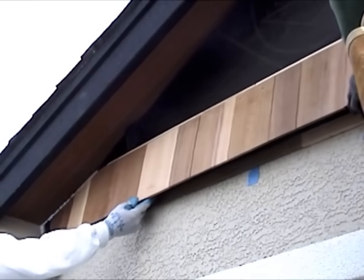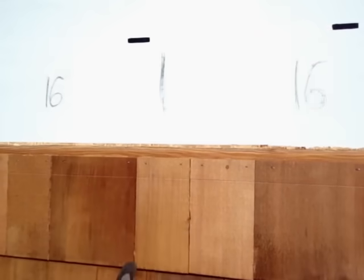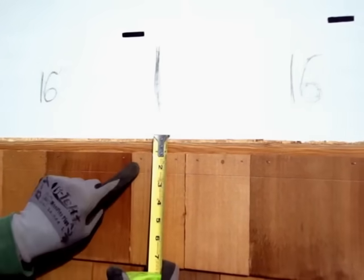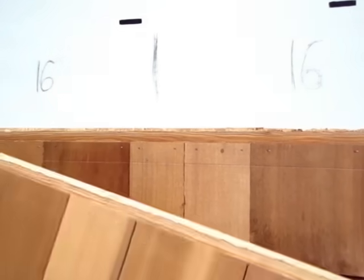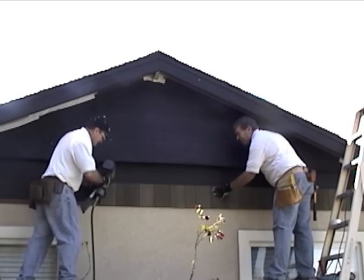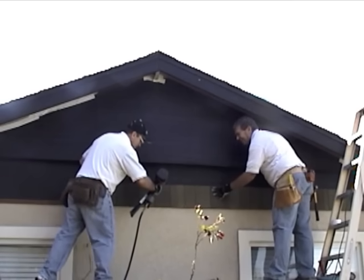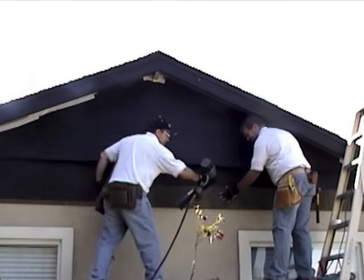Set the panel in place tightly against the caulk trim piece and nail properly. Note, we are blind nailing the shingle panels. The best way to ensure this is to keep the nail right at 1.5 inches from the very top of the Cedar Valley shingle panel, so the next row of panels should cover the nail heads. When nailing, start 1 inch in from each edge and space your nails no more than 16 inches apart. If you need to fasten lower on the panel, make sure to use a stainless steel brad nail.